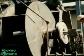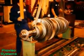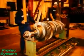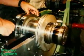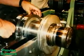Balancing of rotating equipment is recognized globally as an essential requirement in the areas of manufacturing, maintenance, repair and operation of an industrial plant. During manufacturing of a piece of rotating equipment, the rotating components are balanced either as an individual item or as an assembly, or in some instances a combination of both. To balance the components or the assembly, the parts are installed in a balancing machine where a manual balance correction is made.